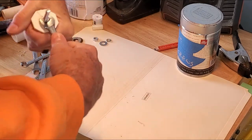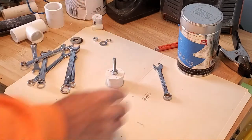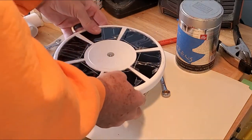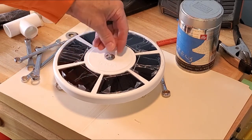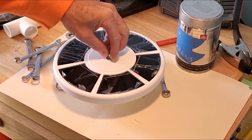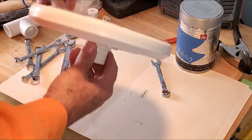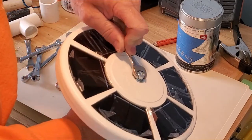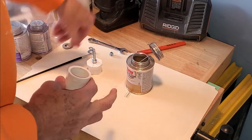The next part was a PVC coupling sleeve. You could use a cap, but I went with the coupling and plug because the plug is flat, whereas a cap is domed on top. I thought I'd get a snugger fit with a flat surface, though with the nut and washers either probably would have worked. The other advantage of the plug is its straight sides make finding the center much easier — I just connected opposite corners to get my center mark, then glued the two pieces together.